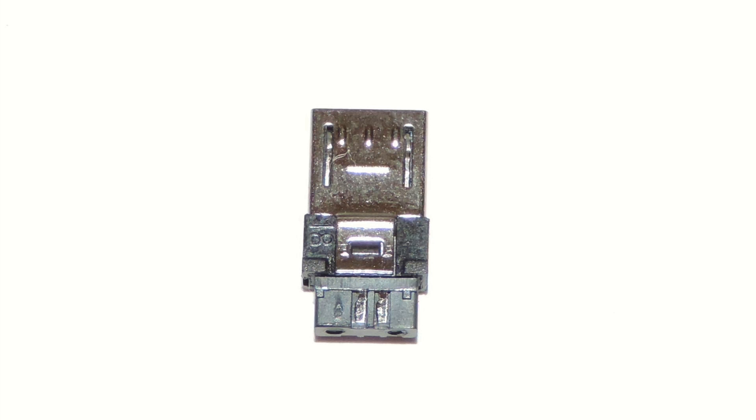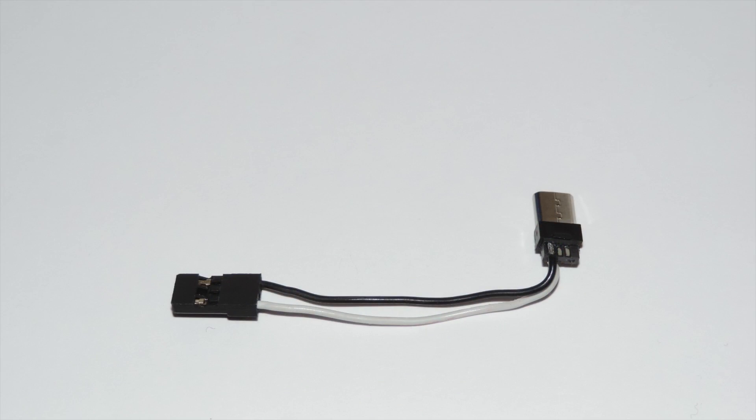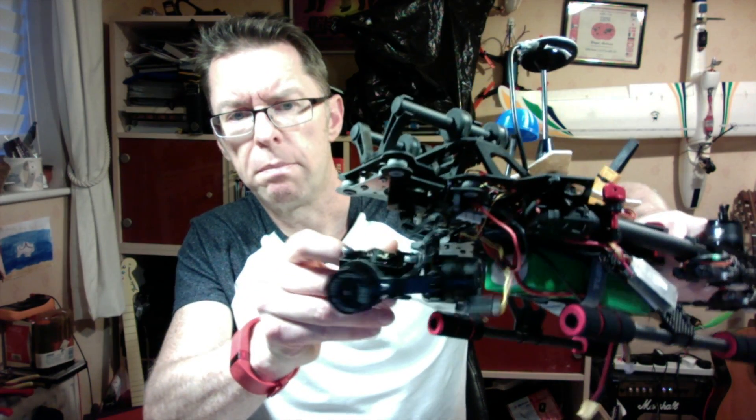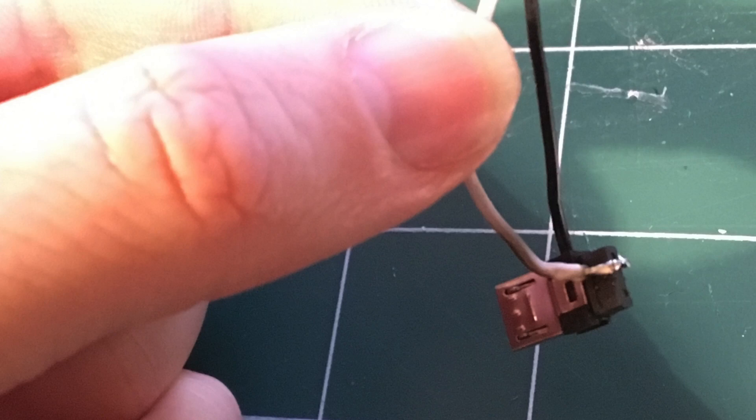So I went and bought my own connectors, which are quite nice because they're easy to solder — three pins on one side, two on the other. My first attempt was fine, but I had so little space between the frame and the cable when it rotates that I had to redo it completely with the cables facing inwards, so it can freely move all the way through.